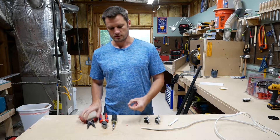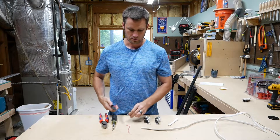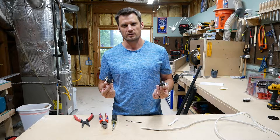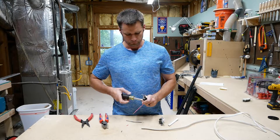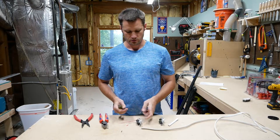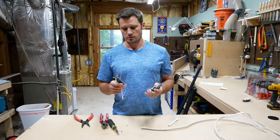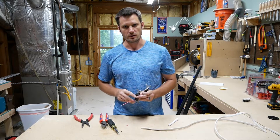Once you've got 6-inch pieces with the ends stripped, you can loop a couple of these. Let's say you've got a couple of switches — maybe you're in a bathroom and one is for the fan and the other is for a light, and they both need to connect with the same hot wire. You connect this up so you've got one pigtail on one switch, loop the other switch — two switches here with pigtails. Each one would have a wire going off to the respective light and fan, or whatever else the switch operates.